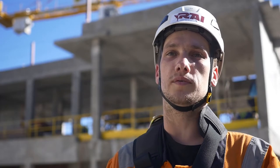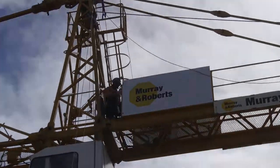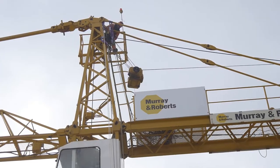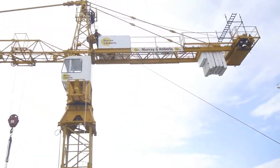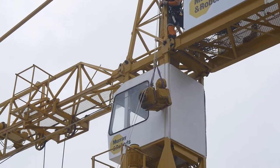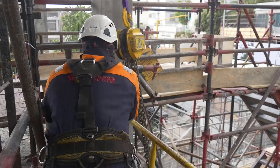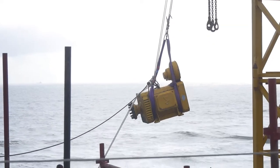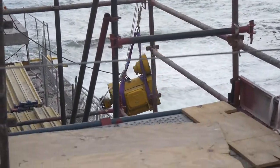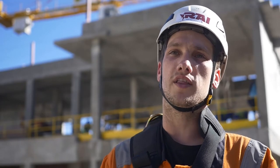Some of the things we ran into were mostly the headroom — not even high points to rig our ropes. We rigged up some staging to try and get us some higher points to rig off, and it seemed to help us quite a bit. The hoist motor of the tower crane burned out. We actually need to get the motor from the back side behind the counterweights, get it to the front side just behind the cabin, and then get it onto level 8 — just the top level above level 7. By rigging it down and then getting the new motor onto level 8, moving it to the rigging point, moving it from level 8 back onto the crane, horizontally back to its position, bolt it down, and then our crane is fixed. They told us the motor was roughly 250, but it was more around 300, just over 300. So we just had to change our rigging and do the load calc as best we could.